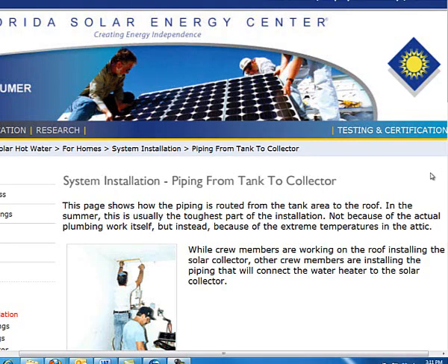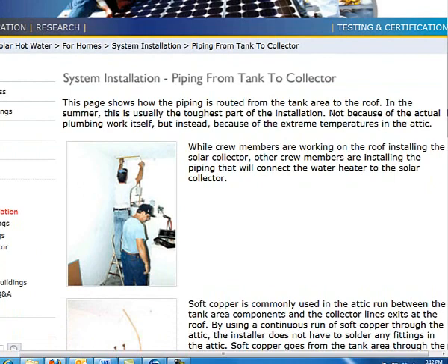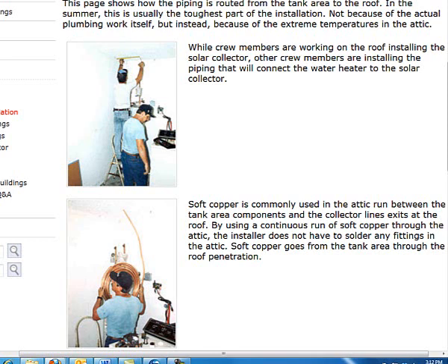There are a variety of ways to move the solar thermal fluid from the collectors to the balance of system. The very first thing you must not ever do is use PEX to run from the solar thermal collectors to your balance of system. It's okay to use PEX to run hot water from your storage tank to your existing hot water system after it's gone through a tempering valve, but you cannot use PEX to take that hot water from the collectors back to the balance of system.